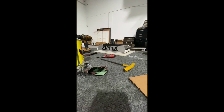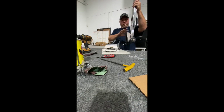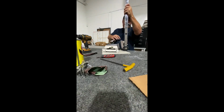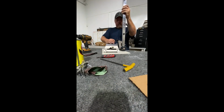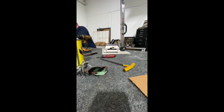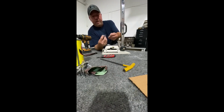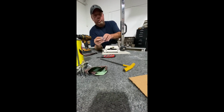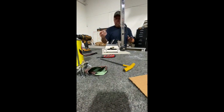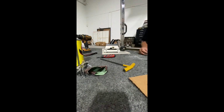All right. So I'm going to line his handle up. Basically, I'm putting this piece of stainless steel here, which I didn't clean, but I'll squirt it on after, between the nut and the knob. See right there? Then we have our 5/16, 18, 1-inch. We put a lock washer and the flat washer. This is an SAE washer. It's a special washer, just smaller diameter. So if you need any, call the office. Tammy will send you some.